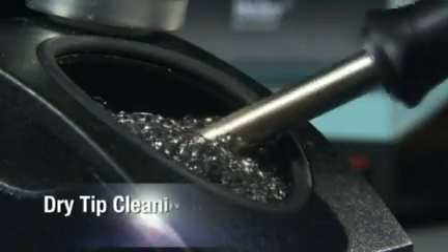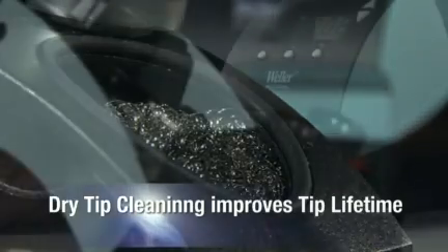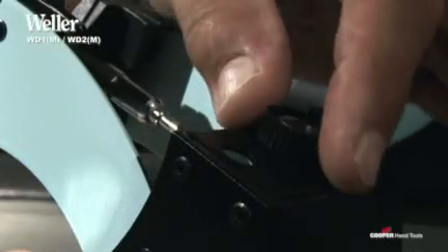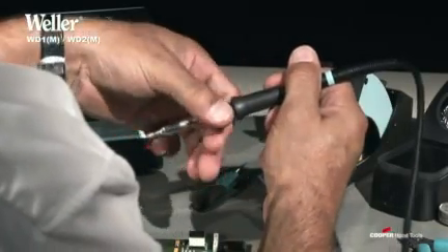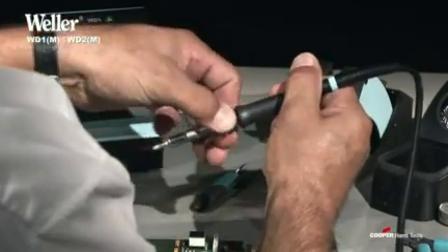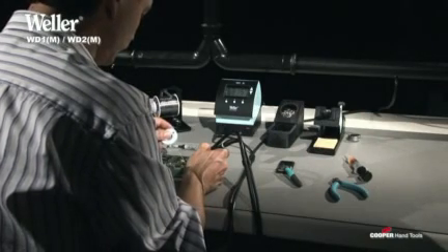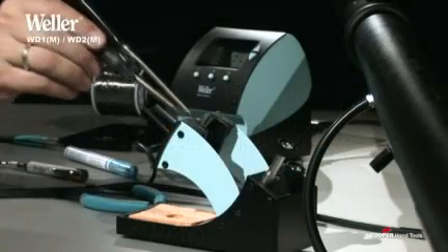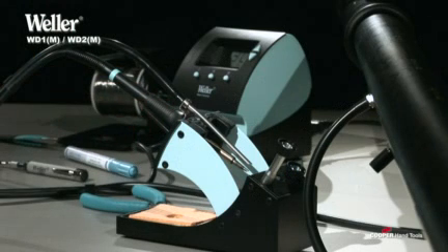The WSP-80 was adapted to meet the rapidly increasing demands of electronics manufacturers. As the fastener of the soldering tips can be freely exchanged, the distance to the soldering point can be varied. Thanks to the technical improvements, the handle temperature could be reduced and the working comfort increased. The solder smoke tip suction for use with the WFE devices can, of course, be retrofitted.